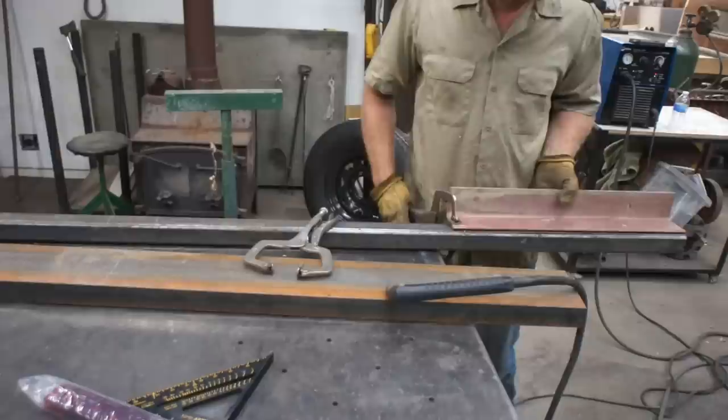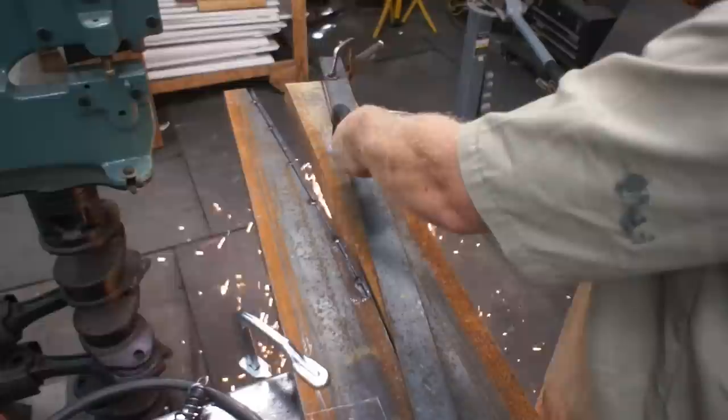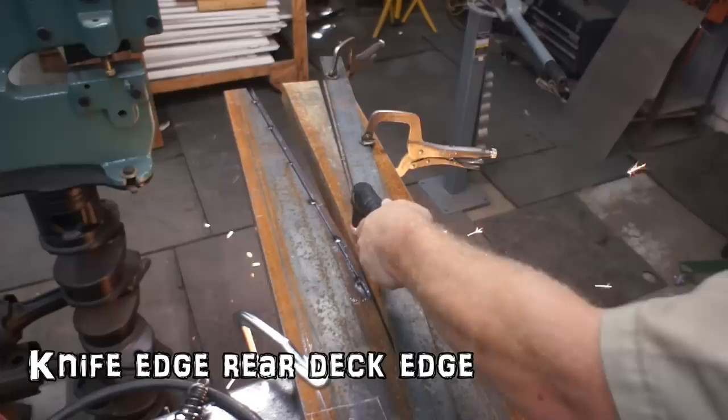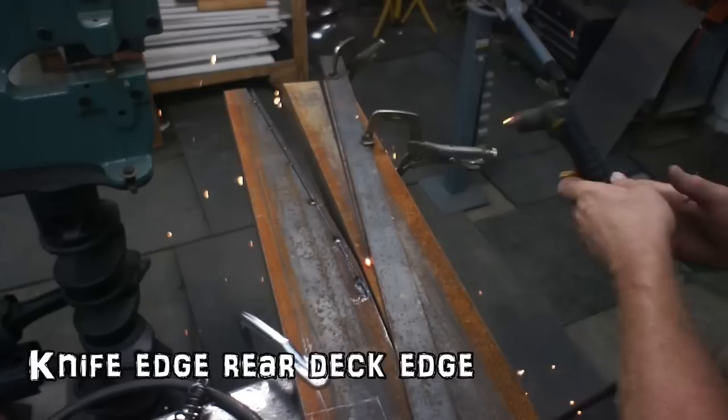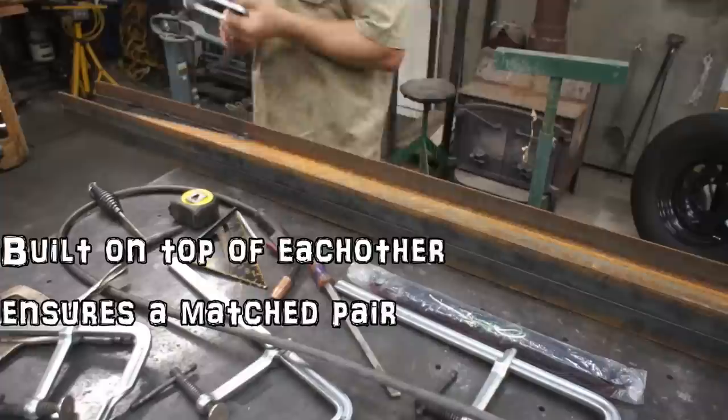When you're doing a lot of forklift loading and unloading of larger or longer materials, this is incredibly desirable. When you put the trailer deck above the axles, it can really make for a tall trailer deck. Now, this can be a positive thing, but it can also be a negative thing. In addition to the lack of fenders, another positive could be on a job site, it makes for a great work surface, a comfortable height to work off of. But on the downside, you now have a very high center of gravity. When you're moving equipment or cars or other heavy items, this is definitely not a good thing.